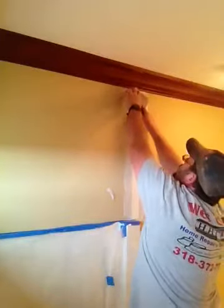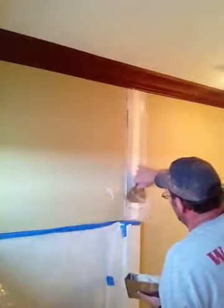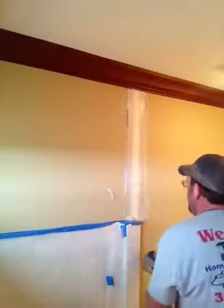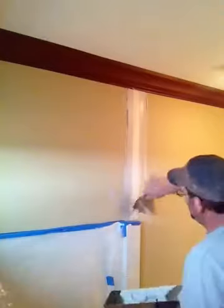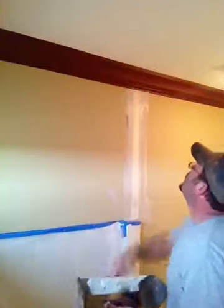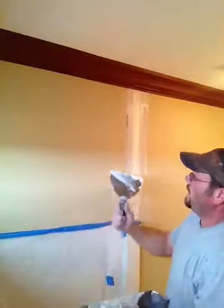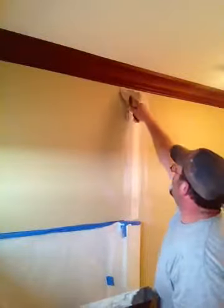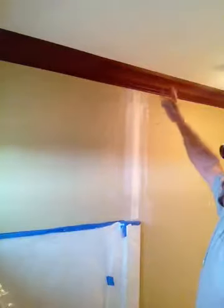Alright, I'm gonna take our knife. I'm gonna pull all the mud out from behind it. Not all of it, I'm gonna leave a little bit behind it. Keep it adhered to the wall. Get the air out of there. Squish that mud out. Okay. Alright. Get off the trim work. Okay. Go down both sides of it. Get all our lines out. Alright, now that's paper taped.